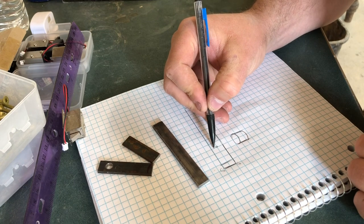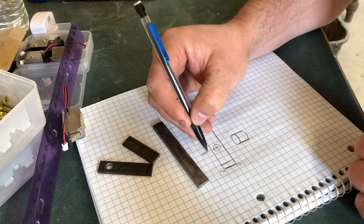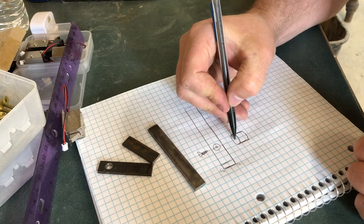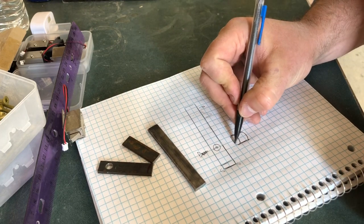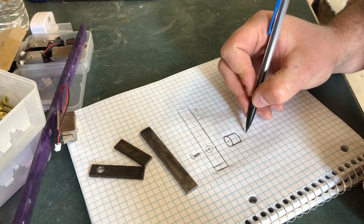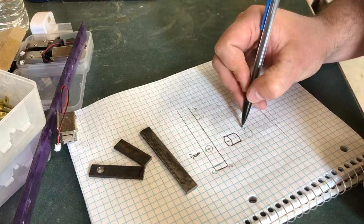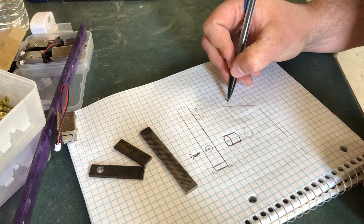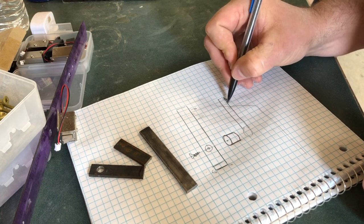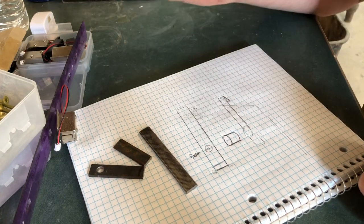And then there, I will have this inset, and my mechanical pencil is about to lose its lead, with a screw going down right there that's not in very tight into a hole right here, and I'll use probably beech on the button here because beech is so dense and hard, and that'll all go inside of the hole that I'm going to drill there in the odd shape drawer thing that I'm building, with the latch that's going to go over to the edge, come down and catch the drawer front, and I'll put a little metal strike plate so it doesn't chew up the wood. And yeah, that should go past a little bit, but I've gotta make a pivot.